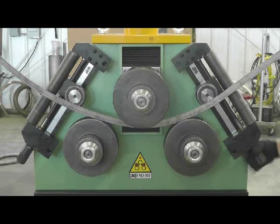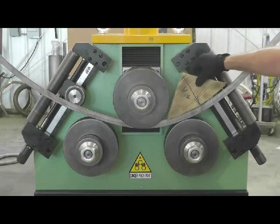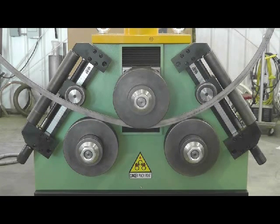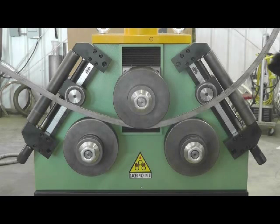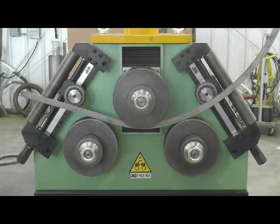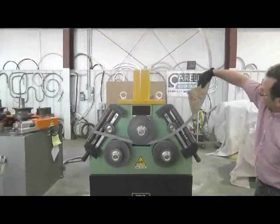That looks almost there. And here we have our four-foot radius. If I want with a wide angle, I can actually manipulate it a little bit as it comes through to keep it flat. It's not necessary that we have to use all of the adjustments of the lateral guide. Here we have our finished part — a flat angle iron that we controlled with our lateral guides at a four-foot radius.